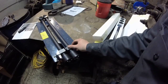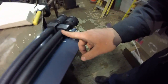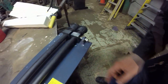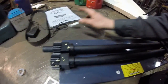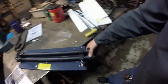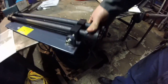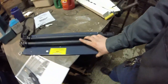These are just steel blocks. I highly doubt they have brass bushings in them, so we'll definitely have to keep this thing oiled. It's not a fast rotation, so it shouldn't be building up that much heat. I noticed they didn't even tighten half these things up, so I'm going to have to go over everything. What I did notice was there's a lot of flex in between here - that's what we're going to have to improve upon. Yeah, look at that - that's just going to be goofy. So let's get this thing reinforced and go from there.